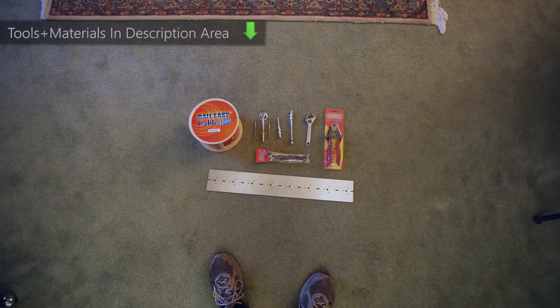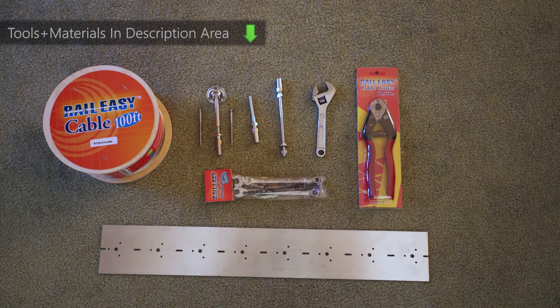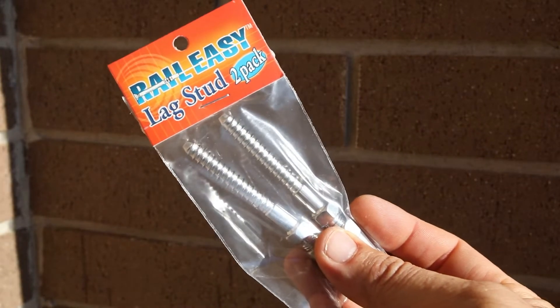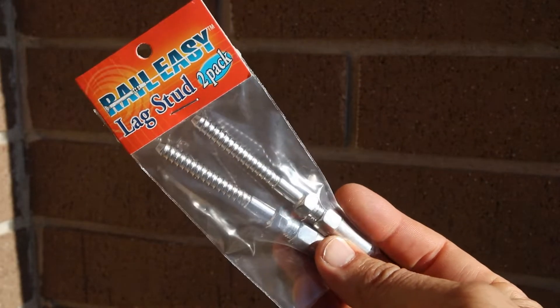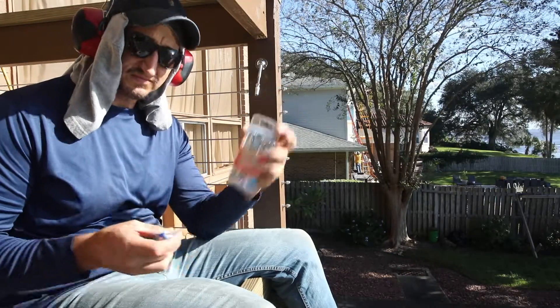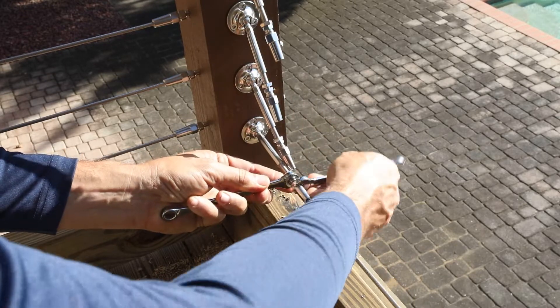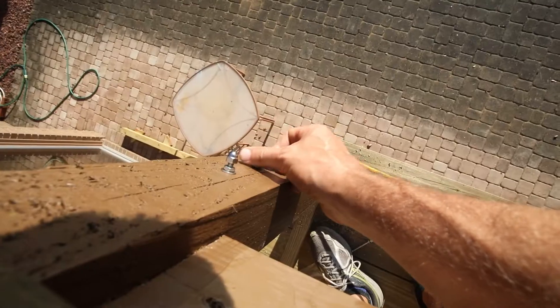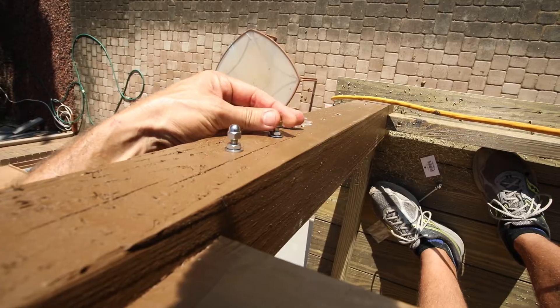With the design done, I figured out what materials I needed. These railing kits come with different fittings for different applications. I used a lag connection fitting — a termination that lags into a 4x4 post. At the other end, I needed cable tensioners; I got two kinds: one where the apparatus screws into the 4x4 with a built-in tensioning system, and one that bolts through the post so you can tighten the bolt to provide tension.